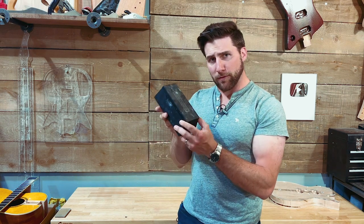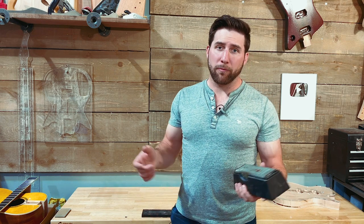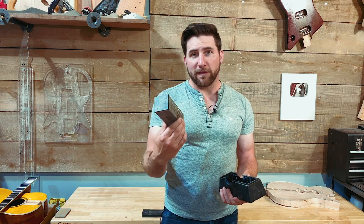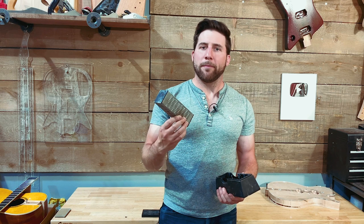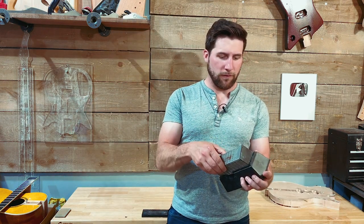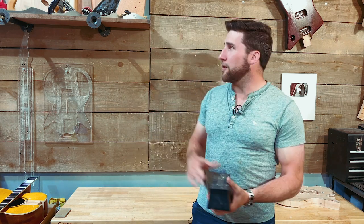I think Ben Crowe from Crimson Guitars has done more sharpening videos using other systems like scary sharp and all that, but what I've got are a few that are relatively easy to find. To start with: a multi-diamond stone sharpening block - this is a Worksmith, I think I got it from Home Depot. You can find these in a lot of hardware stores and tool shops. It's a multi-grit diamond stone. It's actually not really perfectly flat, but it can get the job done and it comes in a non-slip carrying case. If you're just sharpening a few things and you're not super picky, this might be the option for you. For fine woodworking though - sharpening hand plane blades and chisels to the point where you can shave your arm hair - this probably isn't what you want.